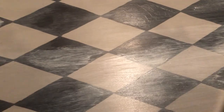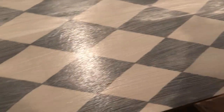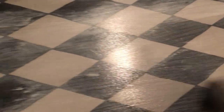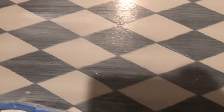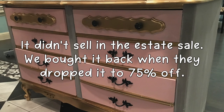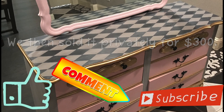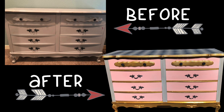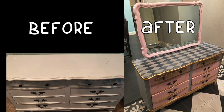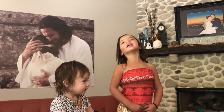This definitely shows brush strokes, so that's why you want to do it in the direction you're painting, or with the grain of the wood. I like that it's helping blend these diamonds better — it's good for my purposes with this project, which is basically trying to hide the imperfections with other imperfections. I just kept adding water to my brush to thin out the lime wash glaze, and I think I actually really like it.